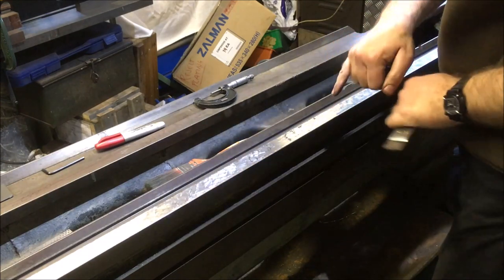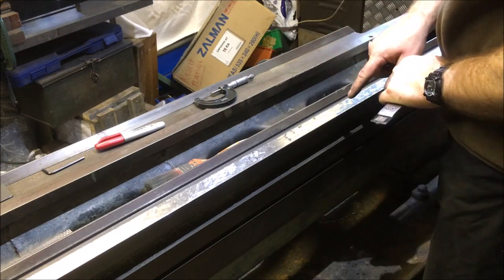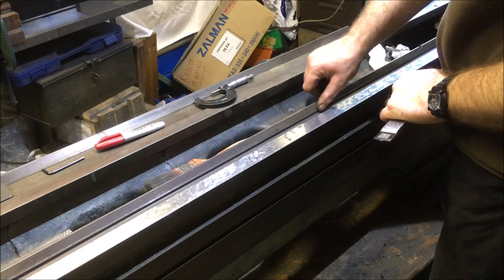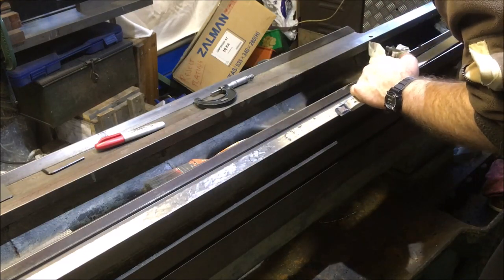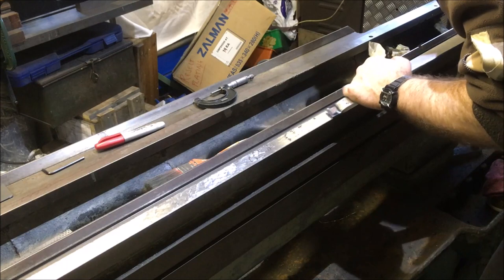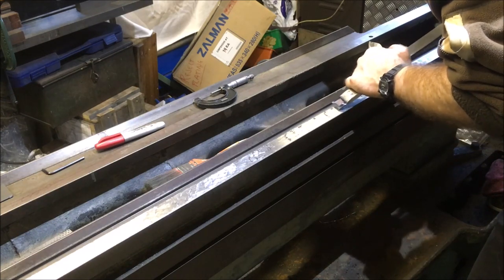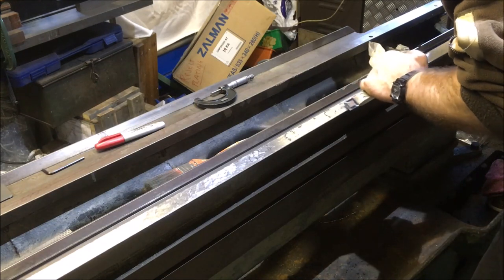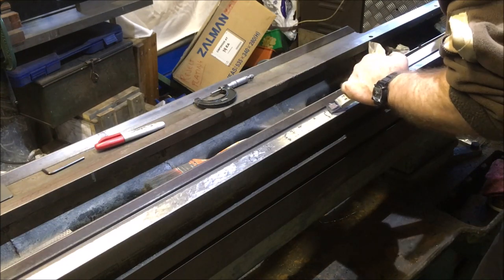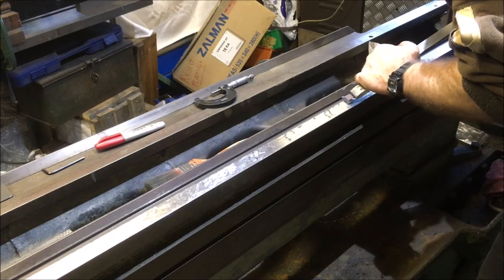What I am finding is the scraper's tip is 30mm wide, and as I'm coming off the end I'm dunking that prism, which is annoying. I could go along and stick some tape over it, but as that's got to be scraped yet, a little row of tiny holes I'm putting in it ain't going to be an issue.